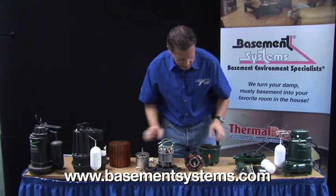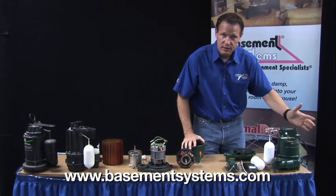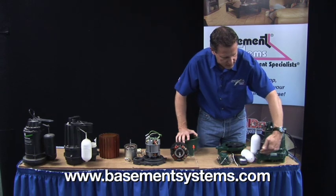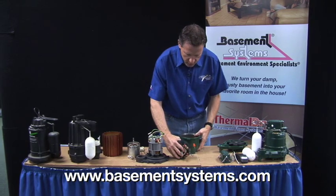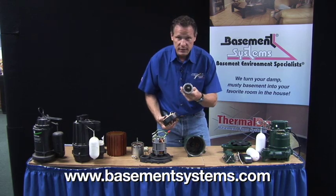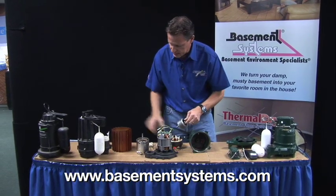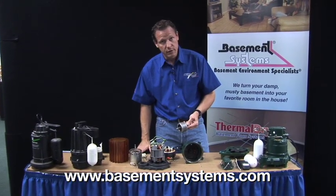We also find that cast iron pumps are the best, and this is the pump that we use. It comes in different sizes and it's cast iron — the top, the middle where the motor is (which is most important) is also cast iron, and the top of where the impeller spins is cast iron. It dissipates heat really well. And the motor, since it's not a can motor, the part that spins can actually connect to the cast iron and dissipate heat a lot better. Whereas there's an airspace between a pump like this and its housing, and it doesn't dissipate heat.